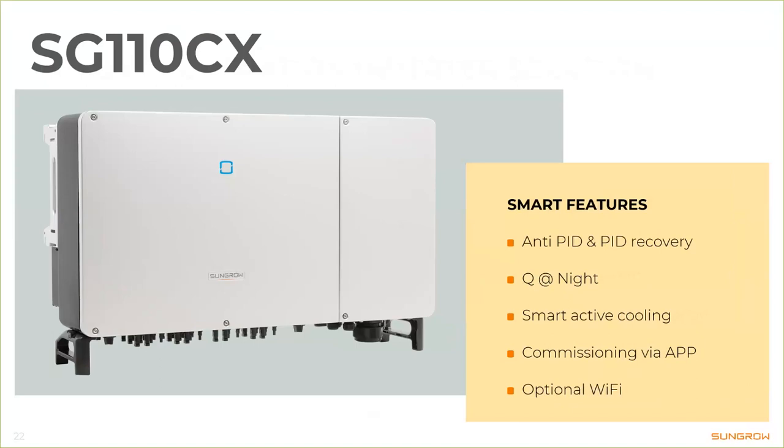As you can see in the picture, the inverter has no LCD anymore, so commissioning is done either by a data logger or via a smartphone app, where we benefit from a high-resolution screen and plenty of text for a smooth commissioning experience. On the bottom of the inverter there is also a communication port where you can connect a Wi-Fi or Ethernet connector — more on that later.